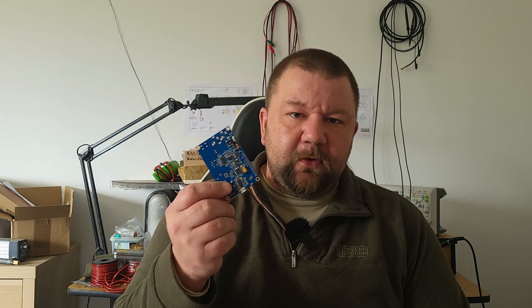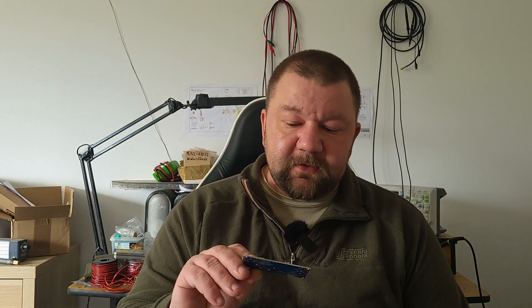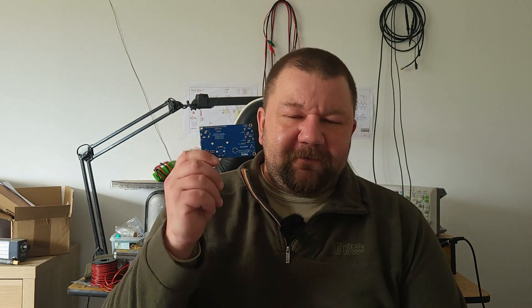In order to prevent this, or at least help prevent a chain reaction, we implemented short circuit protection and over-current protection. This PCB now has a reverse polarity diode and a poly fuse on board. Once we're over a certain current it will just switch off and block the DC path. The fun thing is you don't need to exchange these fuses — they recover over time. Just let it sit for five minutes and your radio is good to go once you've fixed the original issue.